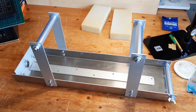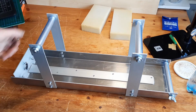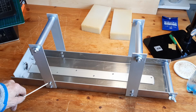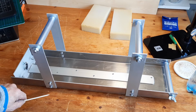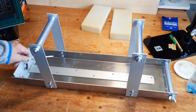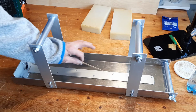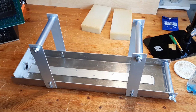So the cradle handles are now fitted. They work fine. M5 bolts and nylock nuts on the outside. The excess bolt I've ground off, and the bolt is put in from the inside to keep this profile as small as possible, so that when the locomotive comes on, the bolt is not going to foul any part of the locomotive.